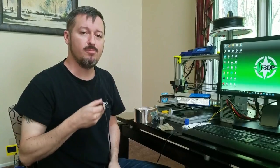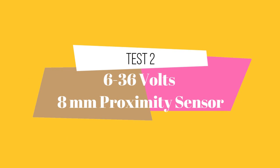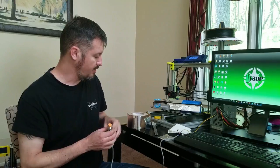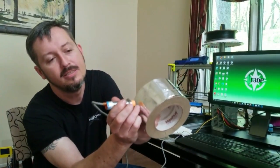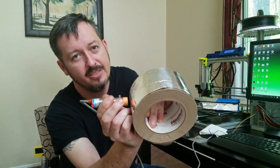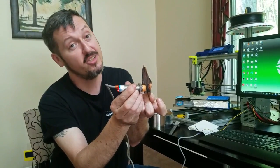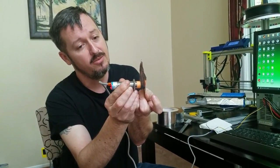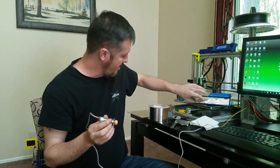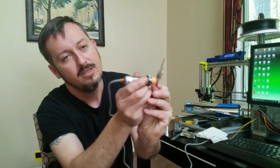So now we're going to test number two and figure out the results — maybe all sensors are different. We're going to try the 6x36 bolt, 8-millimeter sensor. You can see there's a huge difference in the distance it takes to trigger. Again with a single sheet — it triggers at about the same distance. And the last test: household aluminum foil — it triggers just the same.